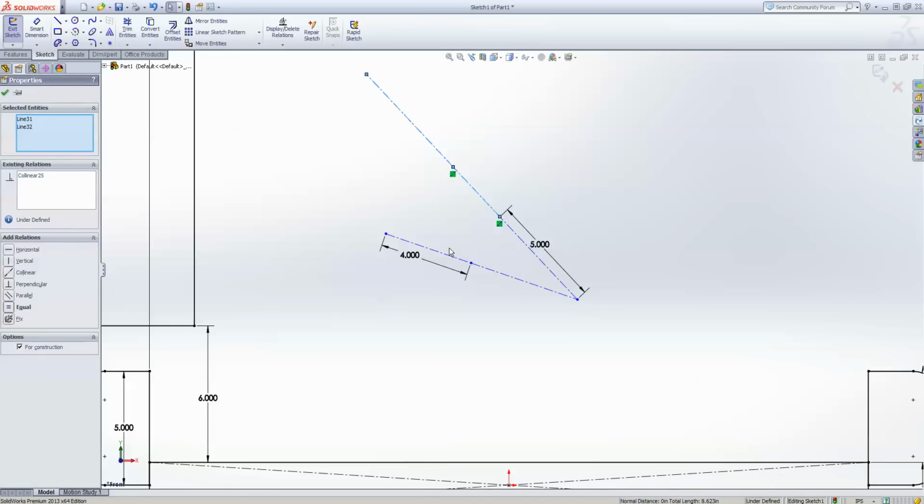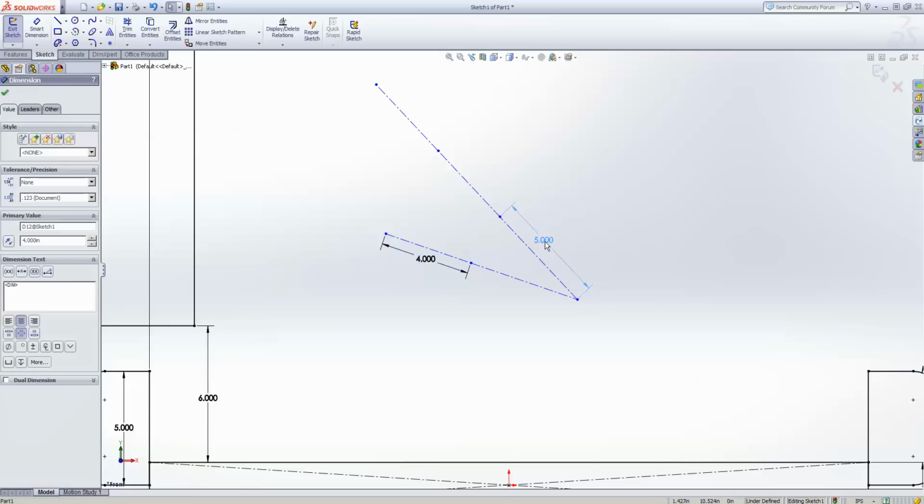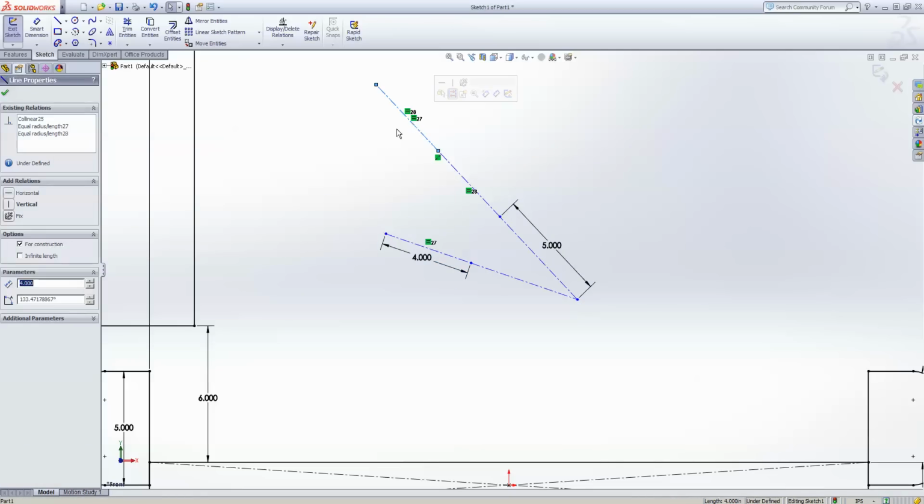And then these two are actually equal to that. So what you end up with is you've dimensioned the base length of the cylinder, doing some math. You looked up that a 1-inch stroke cylinder was, or actually the catalog's really nice, it actually says 3.96 plus stroke. So that 3.96 plus whatever our clevis length is, clevis being the guy you screw on the end, gets you this 5. This 4 inches is your stroke, and this is your longer cylinder where you've extended by stroke.